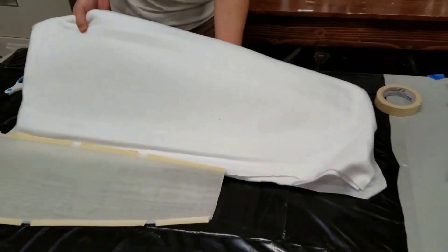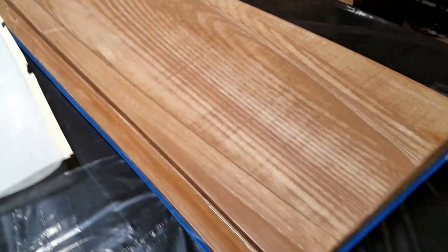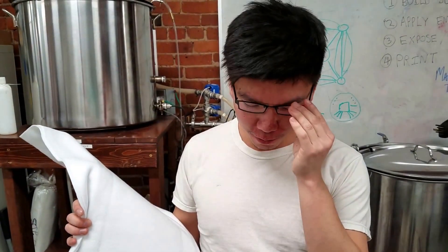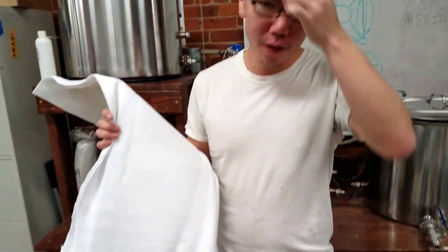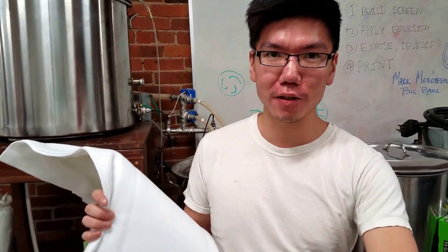So we can take the whole thing out and look at it. There's the mold. So you machined the MDF and then finished it with what? So the MDF when you machine it is like wood — it's porous, so you've got to seal it. You wipe epoxy over it, then sand it, then wipe epoxy over again and sand it until it's just smooth. And then you put a mold release on it so that your part doesn't stick to your mold.